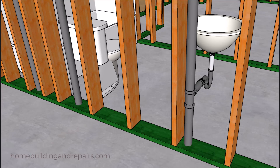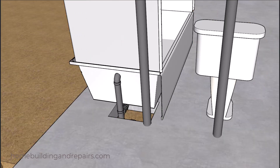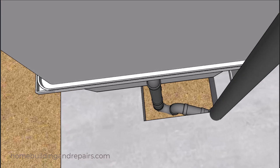I'm going to have a two inch vent for the toilet, and in my example here I have a two inch vent for the bathtub as well. If you're going to have a concrete foundation, you're going to need to box it out before you pour your slab so that the plumber will have room to install the trap for the bathtub.